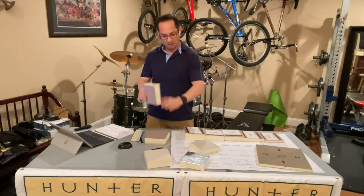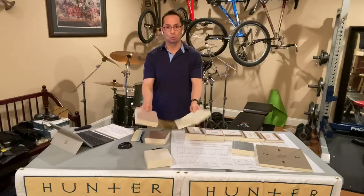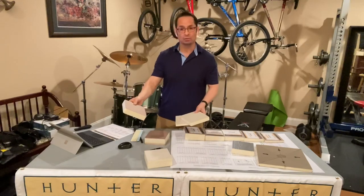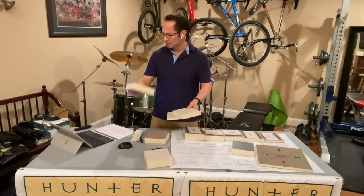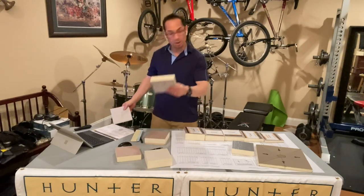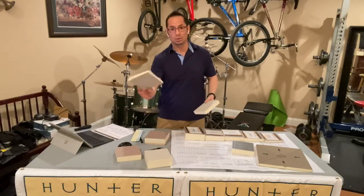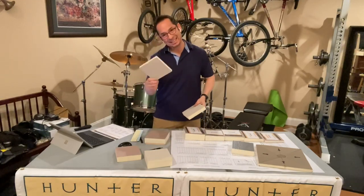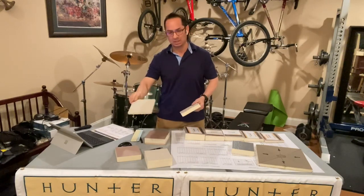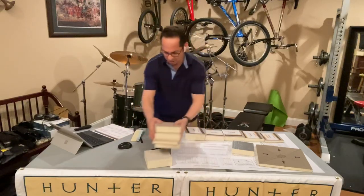Recap, type one, foil. Type two is going to be your standard polyiso with your paper felt on there, or paper facer, glass reinforced felt. Then you also have your type two, class two, coated glass facer. But actually this is a class four. Didn't mean to trip you up. This is a half inch high density polyiso with the coated glass facer on top. Okay, very confusing. I hope you're ready for the test after this, because it's coming soon.